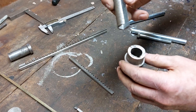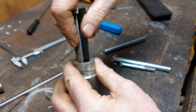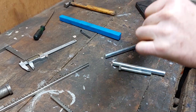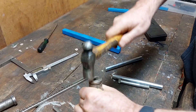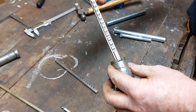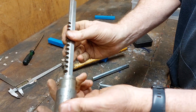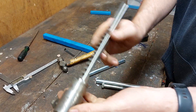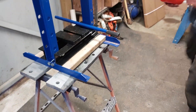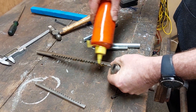I'll start on the opposite side to show you what actually happens. I've got an old piece of steel here where I've already started cutting a keyway. The 19-mil adapter is the right size for the six-mil broach — you can see it fits in and slides through. I'm also going to put a little bit of cutting oil on it just to help it go through a little bit easier.